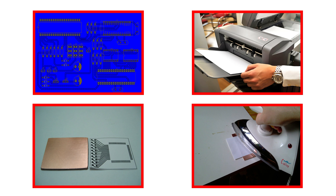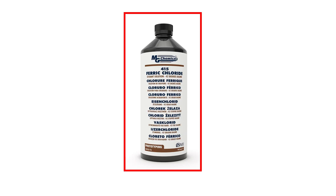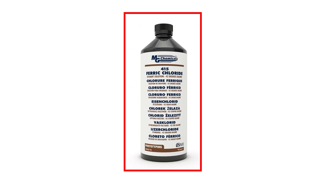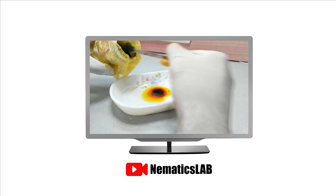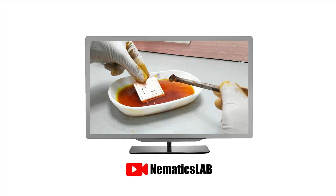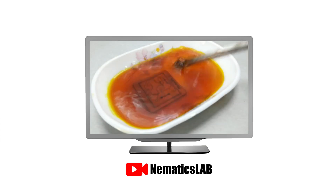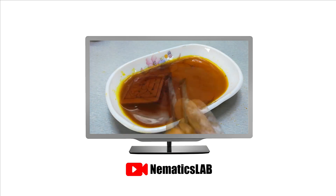Lastly, the process is referred to as etching, which marks the final stage. In this stage, chemicals like ferric chloride or hydrochloric acid are added. However, ferric chloride is commonly used. The ferric chloride is poured into a plastic enclosure, and the copper clad board is fully submerged in it. The etching process can take varying amounts of time, usually around three to four hours, depending on factors such as the thickness of the copper and the concentration of the solution.